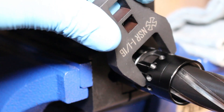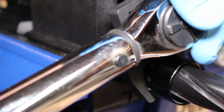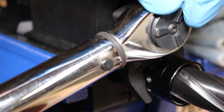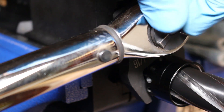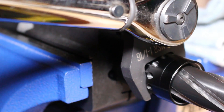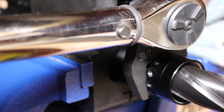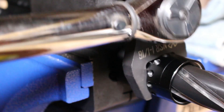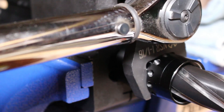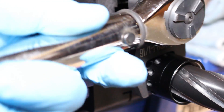Then use your torque wrench — already preset. When you use your torque wrench make sure you're at a 90-degree angle, and only use the torque wrench. I want to torque this to at least 40 foot-pounds. So right there that's at least 30, and then I'll go ahead and increase it to 40 foot-pounds.